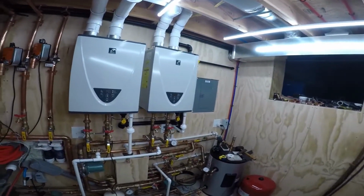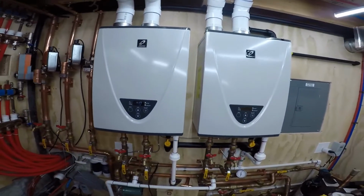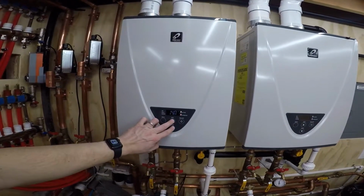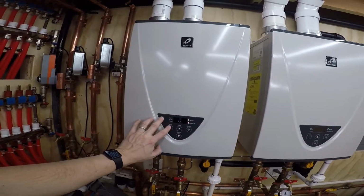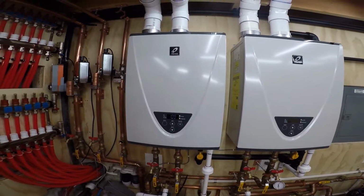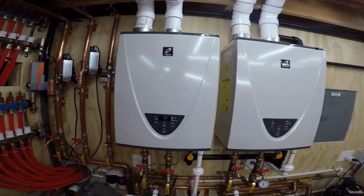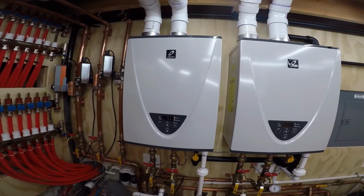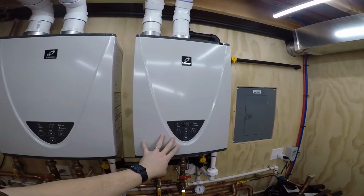The unit's just fired up while I'm making you this video, so we might as well watch them. So they're both on. I can go into the diagnostic mode real quick here. And 0 is for the whole system, and then number 2 is the total BTUs. So this is total. Right now each unit is at 40,000. See what I mean? Now on this one I can get the individual display just for this unit.